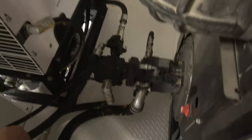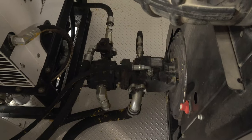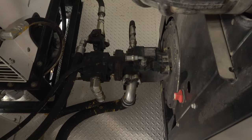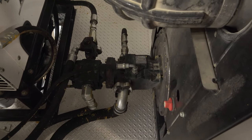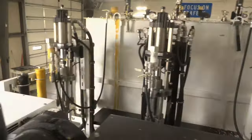The next circuit is your pressure compensated circuit — that's this pump right here, a 2.75 cc pressure compensated pump. That pushes fluid out for your high-pressure paint pumps, steering sector, and your paint agitators. Moving up here to this manifold on the cart.